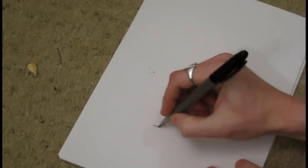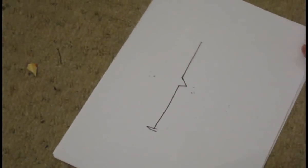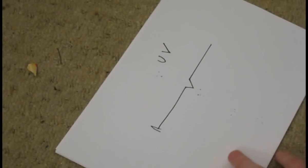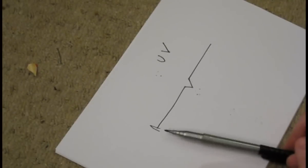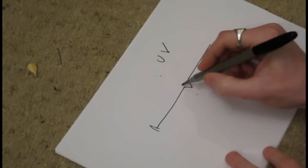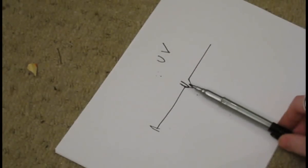Crazy doodle time. Imagine you've got your centre spindle here, and you've got your piece of vinyl and your groove in the vinyl. Now, my needles are spherical needles, which means they're shaped like a sphere. You've also got elliptical needles, which are shaped differently — I'll go into that in another video. Basically, when we didn't have the anti-skate on, it moved to the centre of the piece of vinyl, and that's because the force of the vinyl spinning is pulling it inwards. If you were to play a record with it like that, basically the needle's going to be sitting off to one side — it's not going to be sitting right in the groove, because the force is going to be pulling it out of the groove.